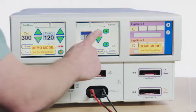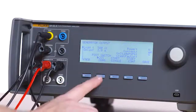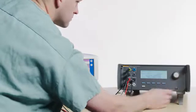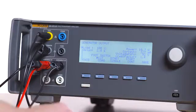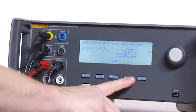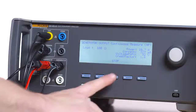Press F1 for generator output, press F2 for cut, select a 100 ohm load, and then F4 for start continuous. Verify current is between 291 and 339 milliamps. Press F3 on the QAES 3 to stop the test. Press standard on the Force Triad, press F4 on the QAES 3 for start continuous. Verify current is between 291 and 339 milliamps. Press F3 on the QAES 3 to stop the test.